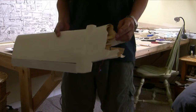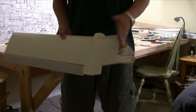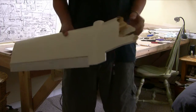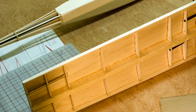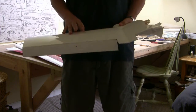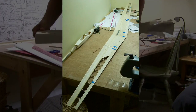As you can see, it broke right about here, which is right where my carbon fiber spars end. So that's where she just folded up. Nothing wrong with my joint design — it's the spars that are the issue. I used spruce with shear webbing, just standard normal construction, with sheeting on both top and bottom of this section. It should have been plenty strong, so I've got to rethink the spruce spars for a wing of this type.